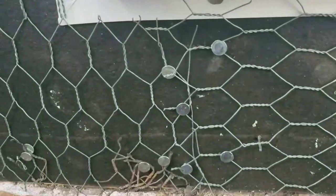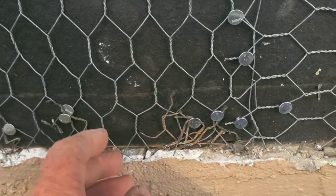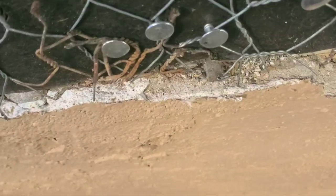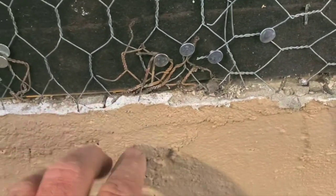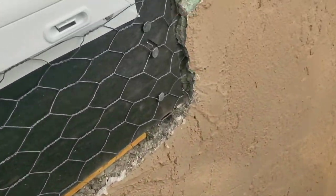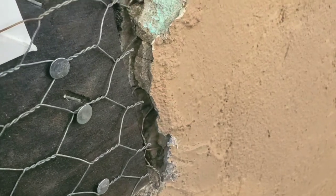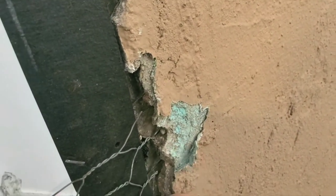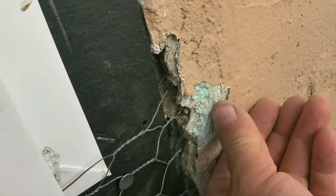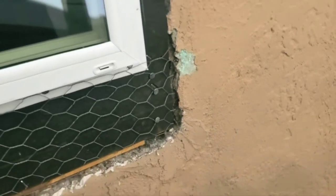There's a ton of nails — I want to get that old wire tied in there. The other problem with stucco is see how thin it is here. I'm going to stucco up to here and pressure wash some of this paint off so I can blend it down a little bit. It still isn't going to match what's there because it's been there for a long time. I know in some places the stucco is really thick — you just kind of have to play it by ear. I also have some bonding agent to put on there to make it stick better — I can't think of what it's called right now.